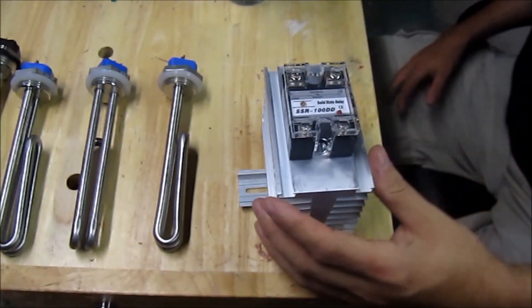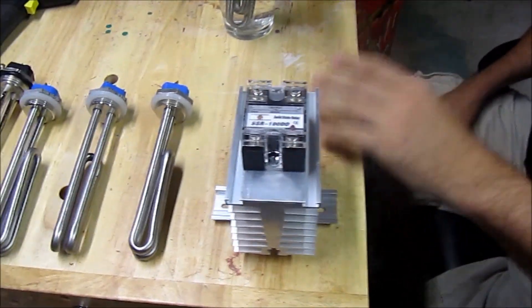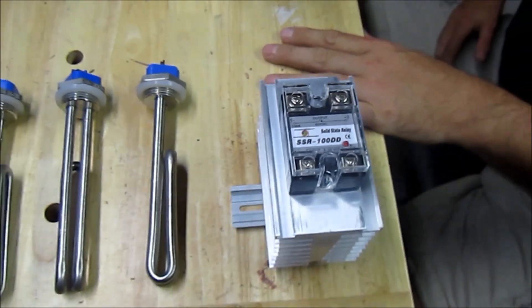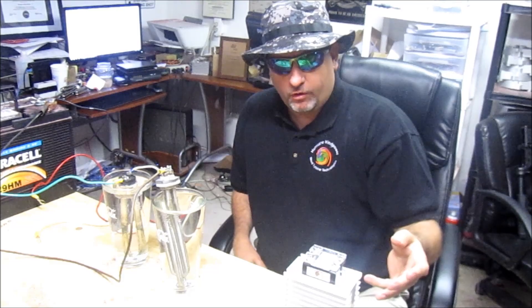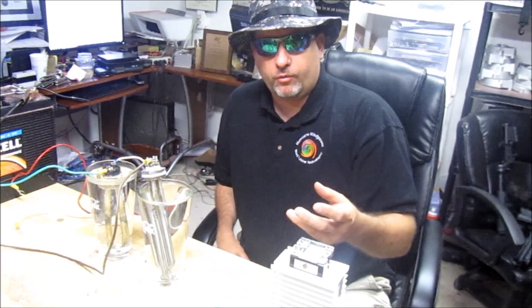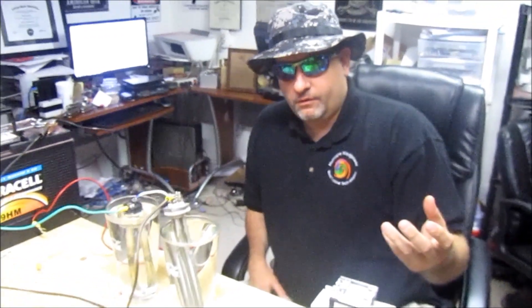This is our actual real 100 amp heat sink that mounts on a DIN rail, with our 100 amp SSR relay. Just for those of you that are new and getting into this — if you see a charge controller, we're using these things to divert the top end of batteries over to hot water for people that have solar. This little brain box does not make a good charge controller. There's no algorithm to it, no bulk, no float, no absorption. It's really not what we would suggest.